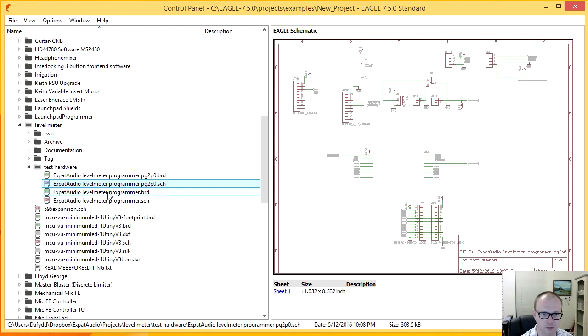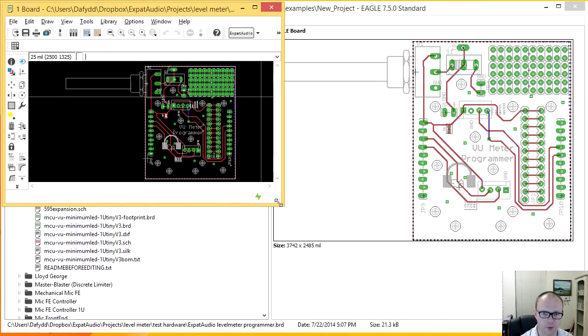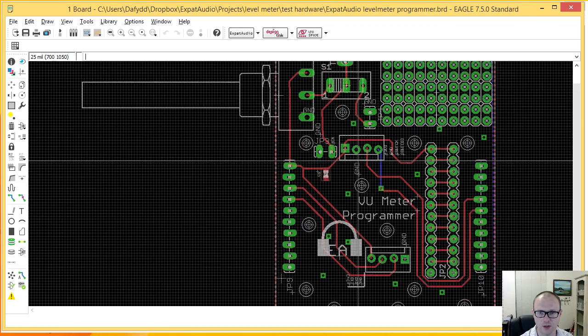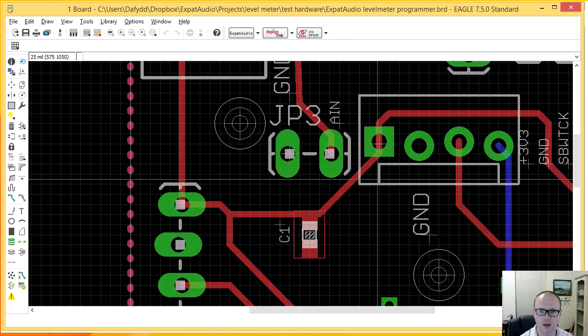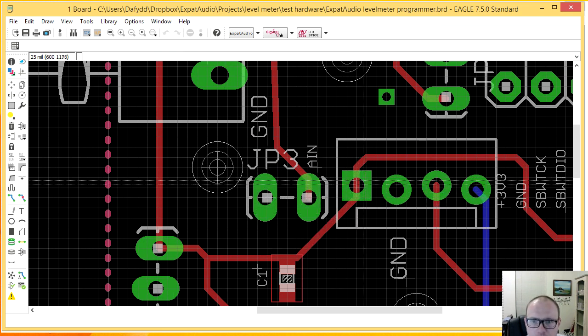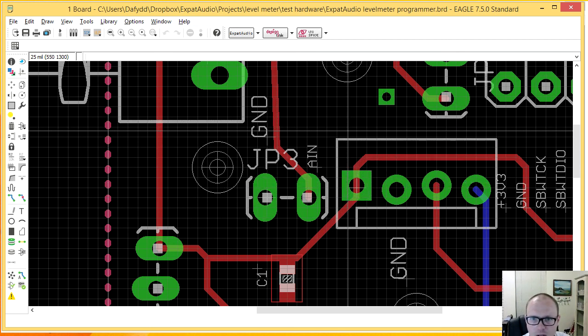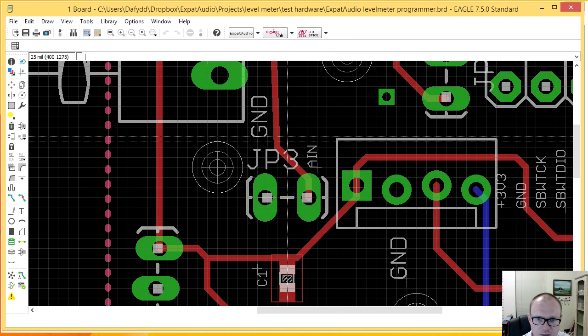And let's have a look at the board. So here's one we cooked up earlier that we've modified since and actually brought into the new tools. And you can see here that this pin is a little further south than the origin here, and a few more pins over. So I'm going to count in boxes here. They're 25 mil each. 1, 2, 3, 4, 5, 6, 7 to the center. Okay, so 7 from the center of this connector to there and 1 down.